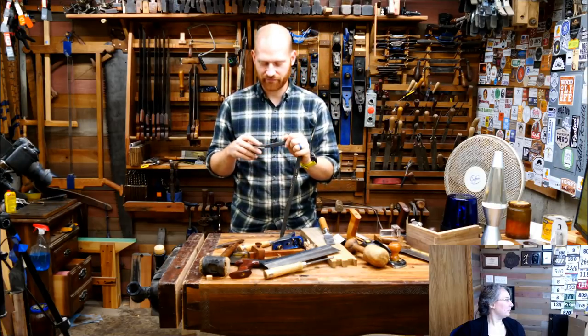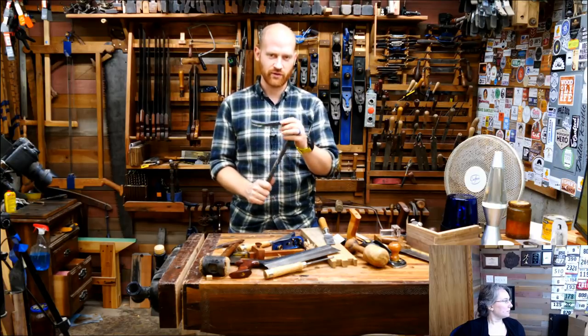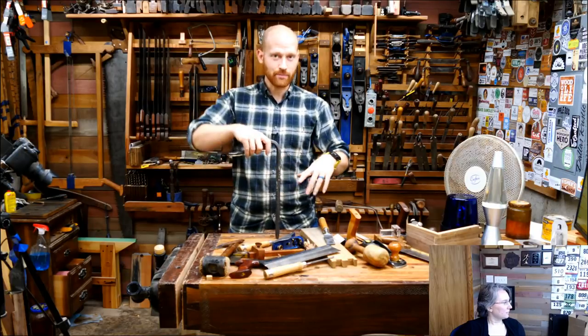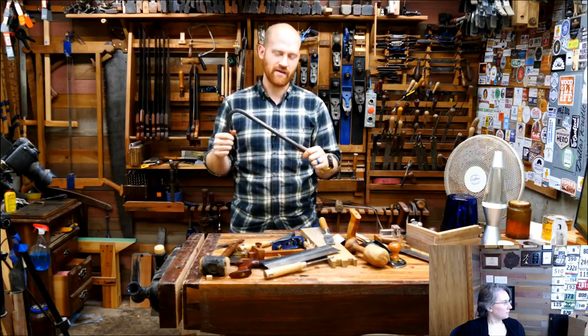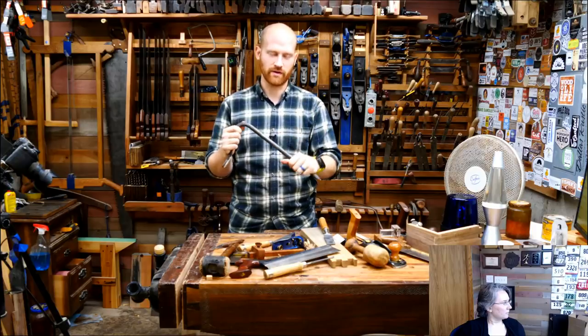So, yeah. I really like his holdfasts. They're just gorgeous. And if you're getting a holdfast, don't get the cheap ones that are cast. Those are the ones you get on Amazon because they snap. The ones from Gramercy are heat bent, but they still have a smooth shaft, and I've had some problems with them not holding quite as well, whereas a forged holdfast has all these little divots that make it hold fairly well.